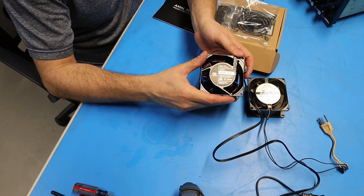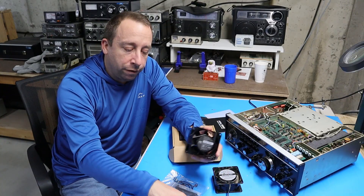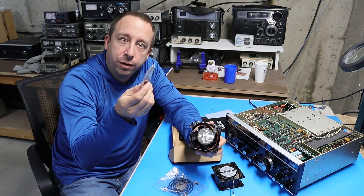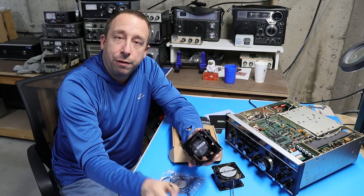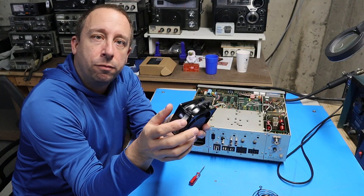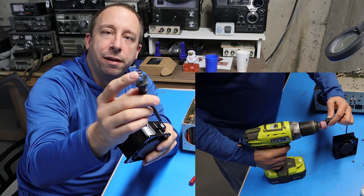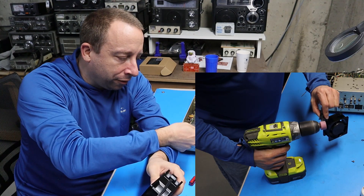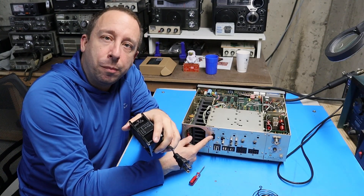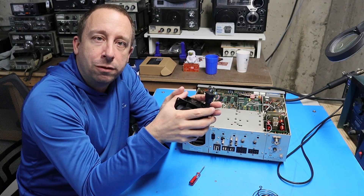The fan feels pretty solid — the outer structure is metal just like the old one, with a fair amount of heft, though slightly lighter. Unlike the old fan, the new one has a separate power cord that has to be plugged in. It also comes with some mounting hardware and a couple of protector grills. I'm going to measure out this cord and cut it to length so I have a short pigtail to plug into the back of the radio. I trimmed up the wire and put some shrink tubing over the solder joints. I also had to grind down the hump on the polarized end of the plug so it'll fit in the non-polarized receptacle on the back of the radio. Normally you wouldn't defeat the polarization, but for this application it'll be okay — just keep in mind if you plug it into a regular outlet backwards after the modification you could get a nasty shock.